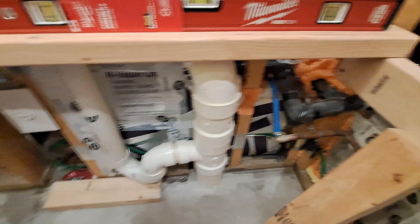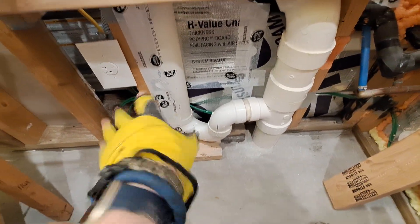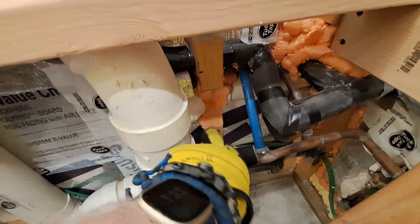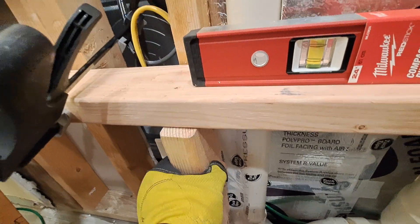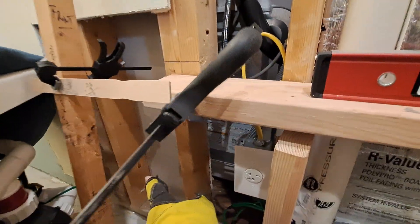So I've got to get some measures. And I'm going to put a two-by-four as a foot, so it'll just be more secure. Instead of relying on screws going through here — which is iffy, because I've got nailers, I've got electrical, and stuff going on — if I build a foot and make it long enough to be a brace, I can screw it in down there, screw it in up here, and liquid nail it down there. And I can do that twice.